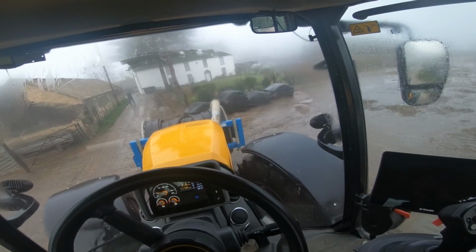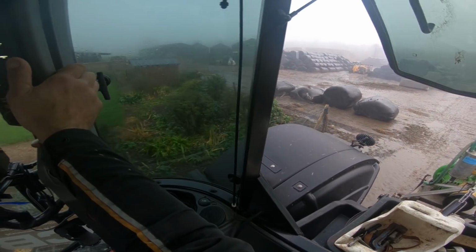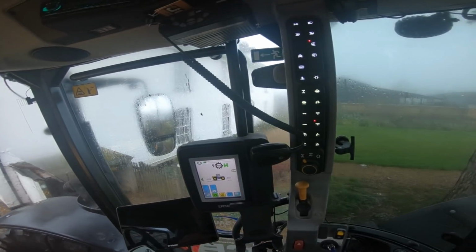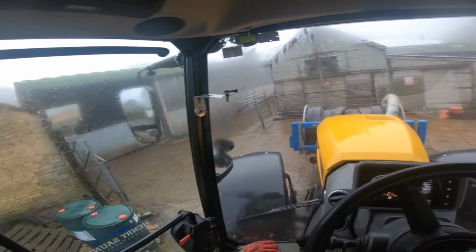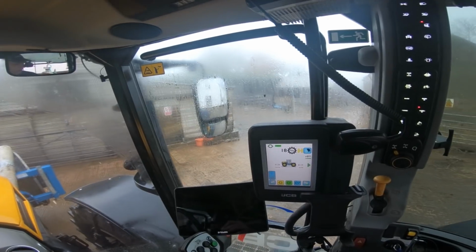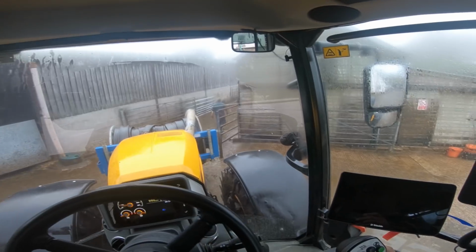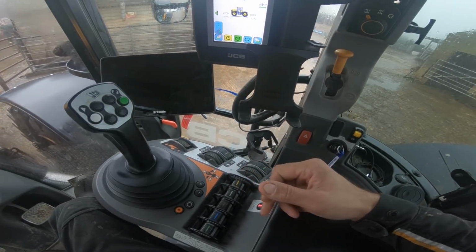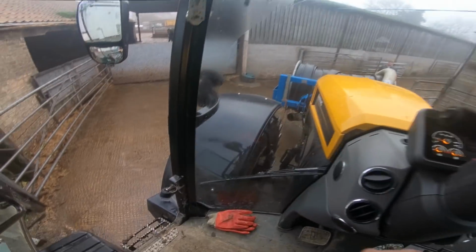Select the PTO, which should be 1000 eco, because it doesn't take a huge amount of power to run it. And the tractor will almost be ticking over when it's pumping. I'll put you into Vario mode. Well, what we'll do now, that little button there selects the spools at the front, because that spool does back and front, so we can put that into float like so, and now we can pull it off. Just pulling this bit off by hand is easiest.